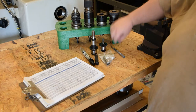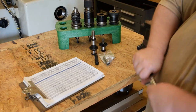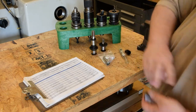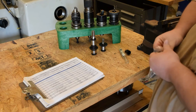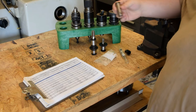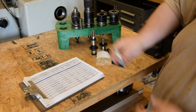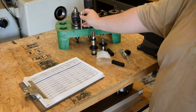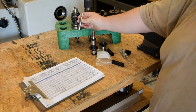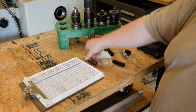I got a collet chuck here for this thing that we made a while back. I got a collet chuck for this big-ass drill bit, and then I got a collet for that Kennametal milling chuck there on the end. I'm going to break it down and take that corner rounder out of it. That's just a straight collet that goes down in it, and inside the straight collet is one of these Acupro 3-flute high-performance aluminum cutting end mills. We're going to really try to blast this material out of here to speed up production on these parts.